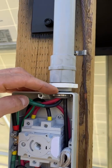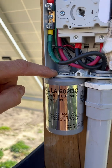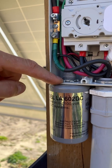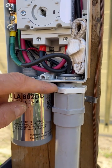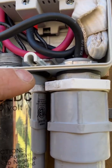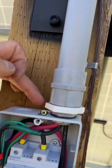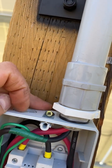Through our connections we've got a nice seal. These teeth on the Delta are really aggressive — they're very hard to undo after they bite in. They're set to be anti-release basically, and these ones aren't quite as aggressive. We have to loosen it off to get that screw for mounting the Delta. If you can see way back in there it's a slot — basically all you need to do is just loosen that one and then this is the securement screw that holds it firm.